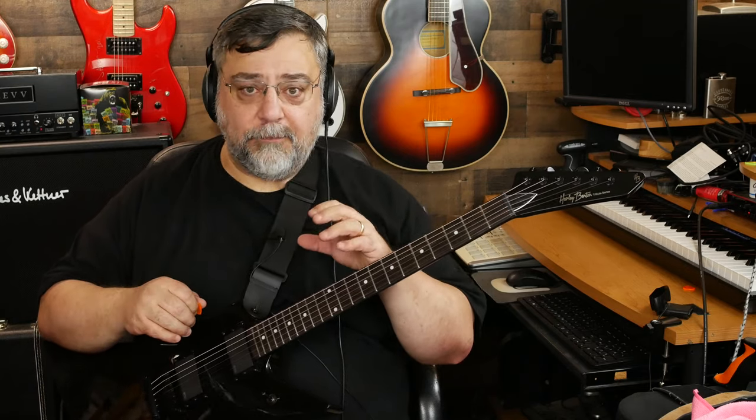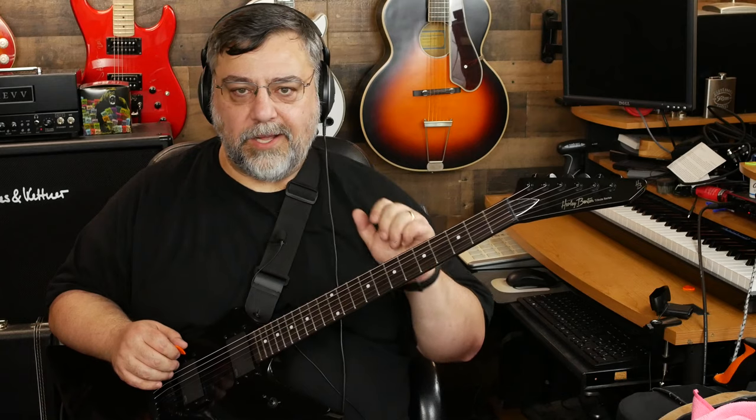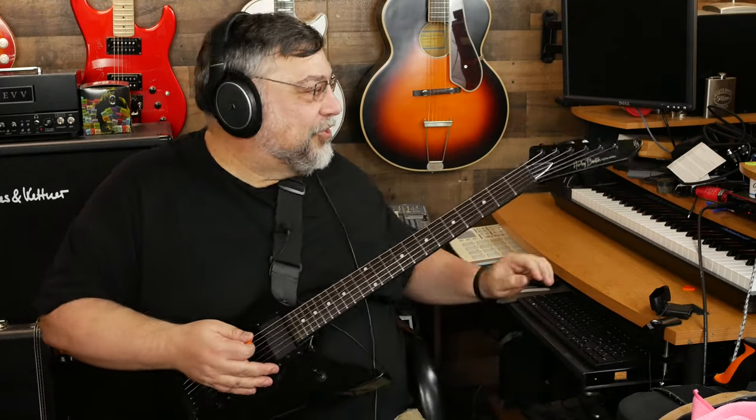The other thing I really like about this is the no-friction pots. I am a huge fan of no-load pots, and that's what they use. Some people say it feels cheap or chintzy without a firm pot, but I don't agree. It gets in the way of me working the volume knob constantly. I don't care for the heavier, grease-filled, hard-to-turn pots. Give me low friction — I'm with EVH on that one.